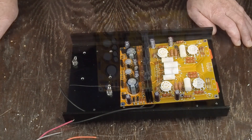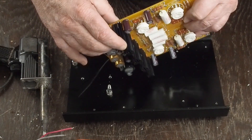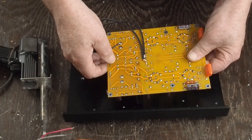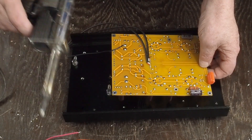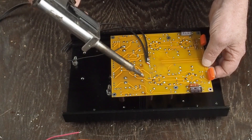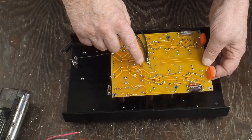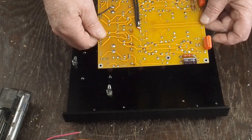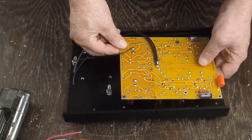It never hurts to be a little oversized on rectifiers. I also want to show you these heat sinks — the little pegs that come out of the bottom go through the board and are solderable to it, which makes them much more stable. My normal soldering iron wasn't designed for something this heavy duty, so I used an old monster Weller that gets super hot and it made short work of soldering those pegs. You'll probably need a heavier-duty soldering iron for those heat sink tabs.